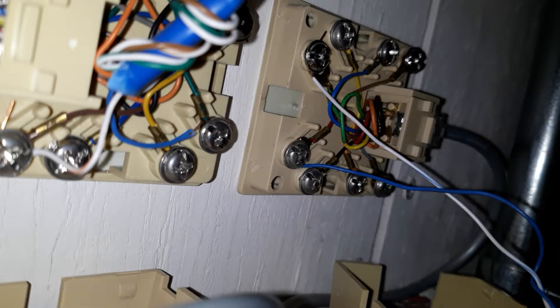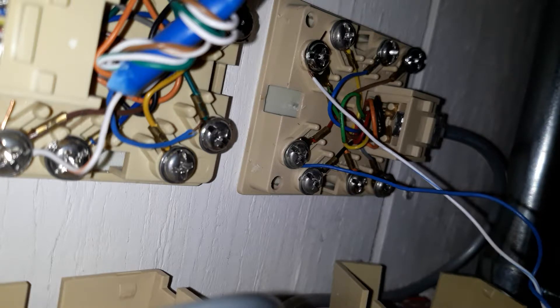My panel just recognized dial tone. You heard that click - that's it saying, okay, I'm satisfied. And when it can't hear dial tone, it looks at voltage. I think it's around 50 volts or something like that that it's looking for.